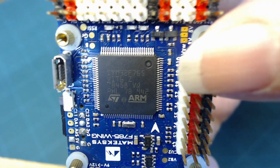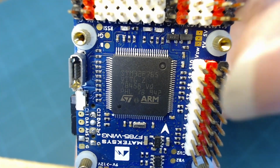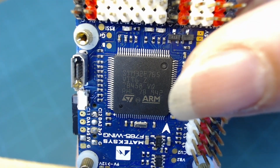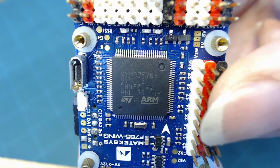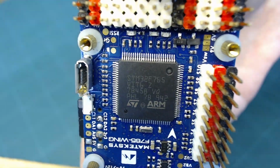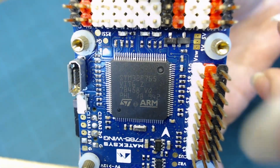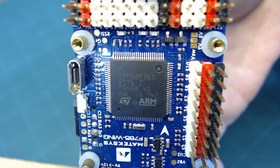So there's typically a number of UARTs on a microcontroller. There are many different microcontroller chips that you can find on the market by different companies like ARM, Microchip, and others. And this particular chip is from the STM32 family, which is a 32-bit chip.